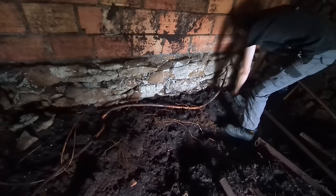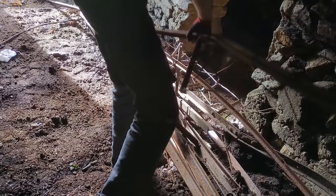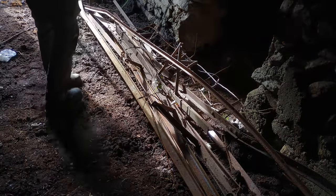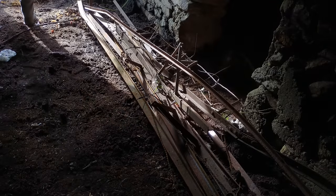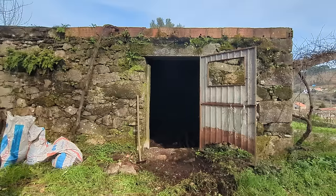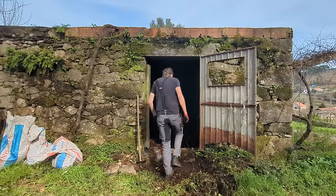Come through the wall. The plan is to have a fair amount of the posts underground to help make them as solid as possible. At the bottom of each hole, we will add gravel or some kind of rubble and fill the holes with fast-setting cement. We are keen to get this done before the summer and have gone round in circles trying to think of the best way to do it.